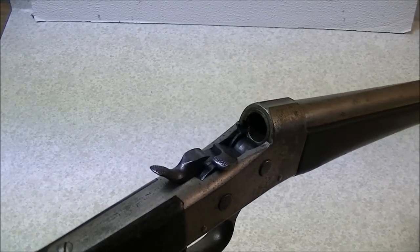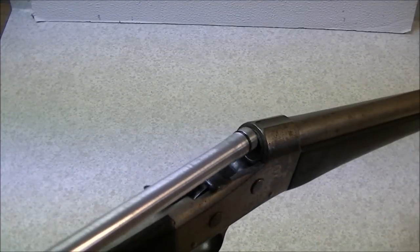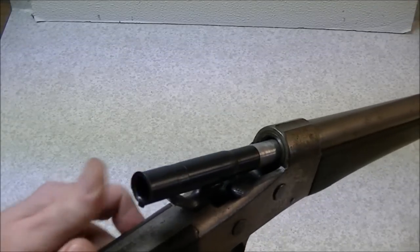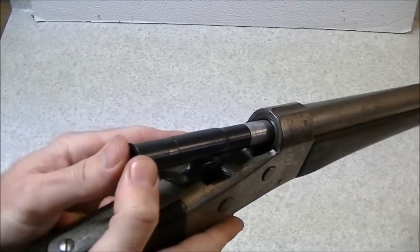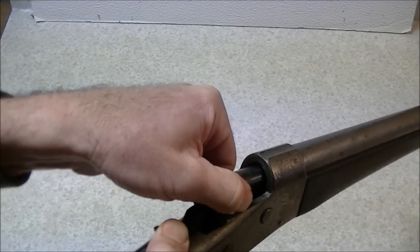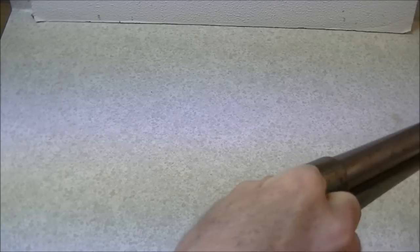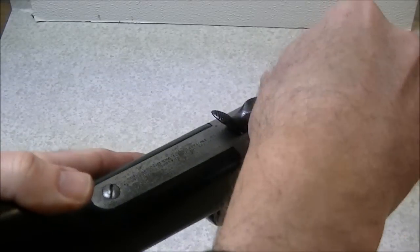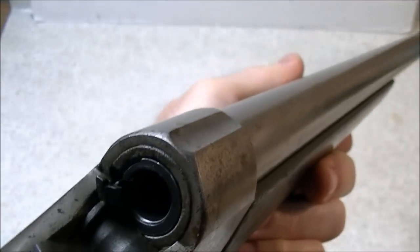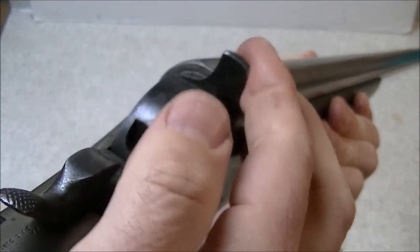Here's another example of a gun action adapted for these insert tubes — my 20 gauge Remington rolling block. Because you can get at the breech end unobstructed, you can use one of these tubes in it. There's a little trick to getting it in because there's a clearance cut on the bottom of the tube that has to be lined up with the rolling block. But if you get it lined up properly, you can get the adapter past it and then carefully rotate it to line up with the extractor on the rolling block. It fits quite nicely and we've adapted this rolling block to shoot 410.